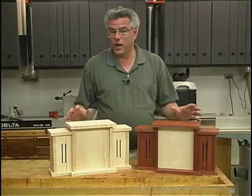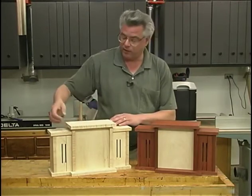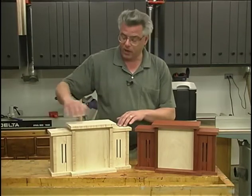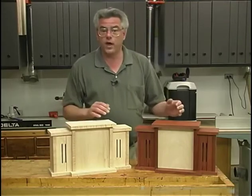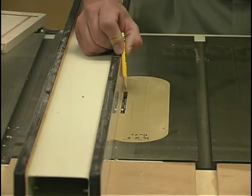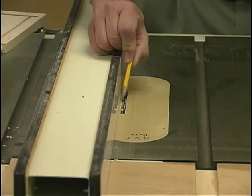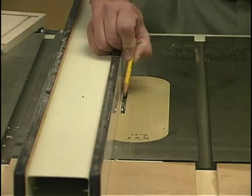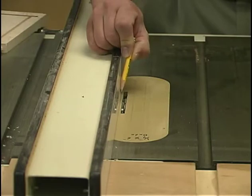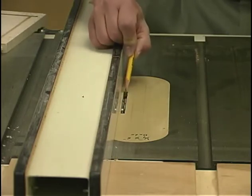With all of the primary joinery now done I've gone through and assembled everything making sure everything fits up good. Now we can turn our attention to some of the decorative elements — the edge banding that we're going to place around the top three pieces and along the edges of the bottom piece. We'll do that over at the table saw. While this operation could be done at the router table with a quarter-inch or three-eighths inch router bit, I find that my stacked dado head cutter gives me a nice clean groove. The setup is very simple: an eighth inch between the edge of my blade and the fence, and the stacked dado head cutter — which is a quarter of an inch — is raised up an eighth of an inch. I'll have to pass the board through twice, once with each face against the fence, to make sure this groove is nice and centered. Note the zero-clearance throat insert plate — if I was using the stock dadoing insert, my workpiece would probably pass right down inside the table saw, creating a very dangerous situation.